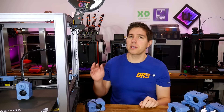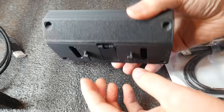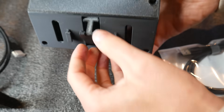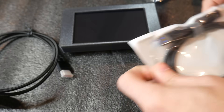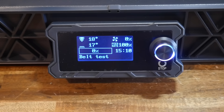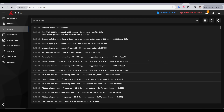A reasonable start, but this printer is not going to become a tool changer by itself, so let's take some baby steps towards that. In my request to Sovol, I asked for them to include the upgraded touchscreen, hoping that it would be running Klipper Screen, and that would make it easier to execute macros related to the tool changer. It came pre-installed in a 3D printed box along with USB and HDMI cables. When I went to the wiki and looked at the firmware update log, I was pretty sure I already had the latest version, because the belt tension test was already present in my printer's menu. That belt test runs a macro that auto-tunes input shaping, automatically storing the results when it's done.